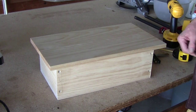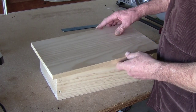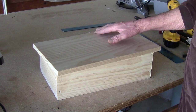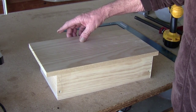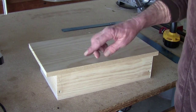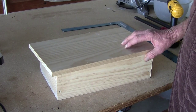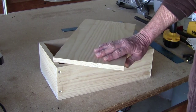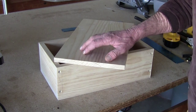Now that it's been through the table saw - cut to 17 and then nine and three quarters - remember this side was already jointed, but since you cut it off you're going to want to send it through the jointer one time, which I did already. From here we're going to the bench sander to sand both end grains, because like I said end grain is so hard it still has the 80 grit on it.